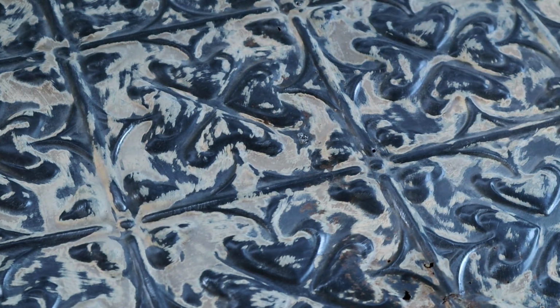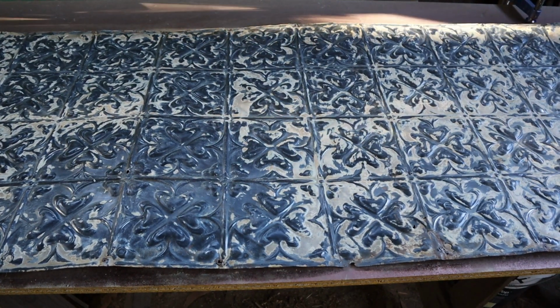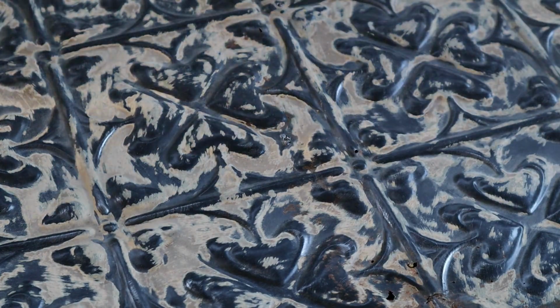This third sheet shows a pretty good example of minimizing your paint stripper. On this sheet I decided to thin it out a little bit and not go as thick. Now I did leave it for well over half an hour, maybe closer to an hour, while I went and had some lunch. But when I came back to it, half the sheet was a little bit mushy and the rest of it had almost dried. But there is a lot of paint left on there from decidedly using a lot less paint stripper. I just thinned it right out, hoping it would do the same job.